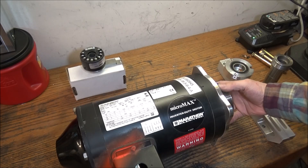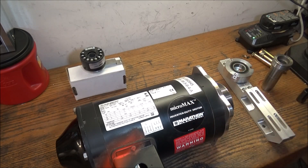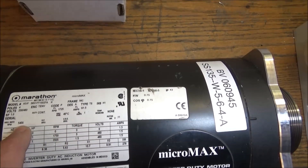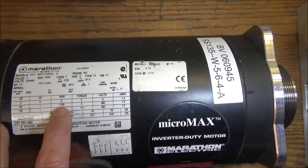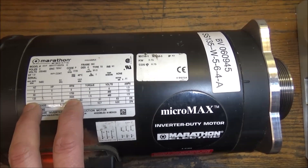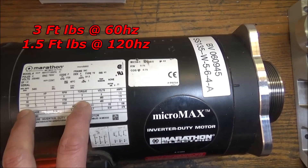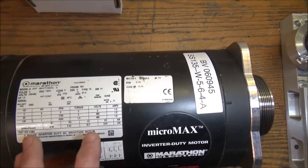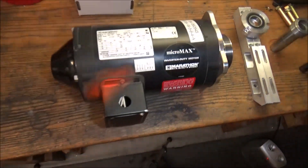This is about a seven to eight hundred dollar motor normally. What makes it so special is it's inverter duty and the torque ratio is a thousand to one. It has a maximum safe speed of 5400 RPMs — it runs at 1750 at 60 Hz, but it'll spin at 3505 at 120 Hz, which is about where we're going to be running it. Torque is rated at 3 ft-lbs at 60 Hz and 1.5 at 120 Hz, but with a thousand to one torque ratio these motors are really a beast. I'm excited to get this motor installed on the original machine.